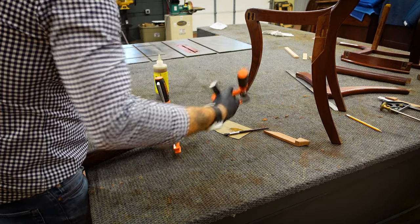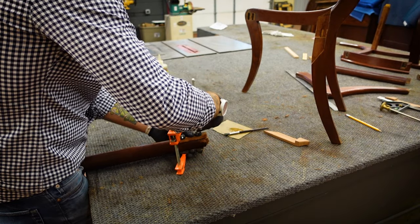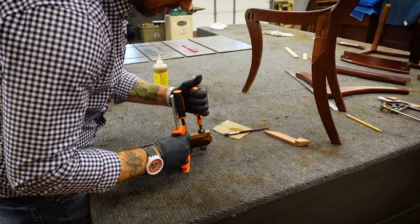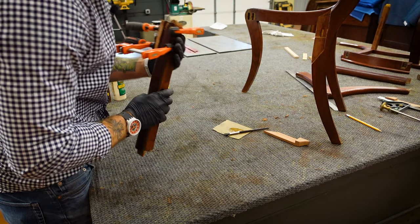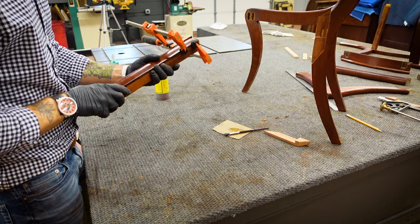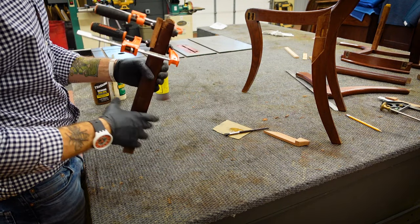Anyway, all right. I'm gonna run these clamps opposite too, just to create a little extra tension. I wanna even that and distribute that weight of the clamp out evenly. One pulling this way, one pulling that way. All right, cool. That's on there really nice and tight. I got this pretty well aligned. And then, when we're done, we'll just clean up that bullnose on a bandsaw and do some finish work.